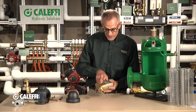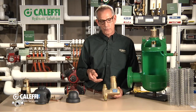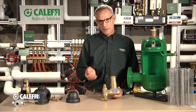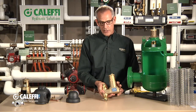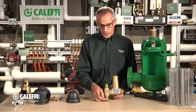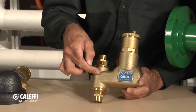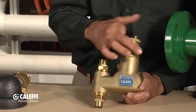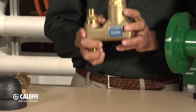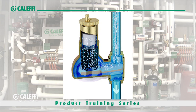New to the Caleffi Discal lineup is our new Verticals, and this is a great product. What's happening on the market is we're seeing more and more wall-hung boilers and tankless-type boiler combination packages coming out, and they're going to have their piping coming out of the top or bottom. This allows you to use it in either direction — if the flow comes up through there, we built a passageway inside so the flow goes around through the elimination media and then back out. You don't have to do elbow after elbow. It's a nice clean-looking package for a vertically piped system.